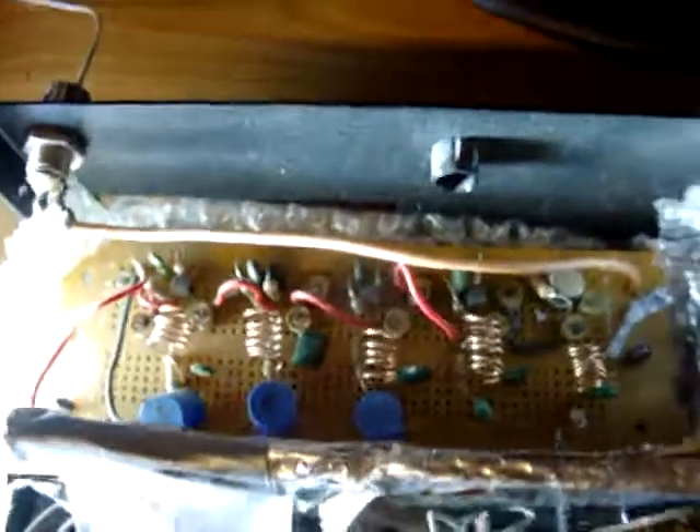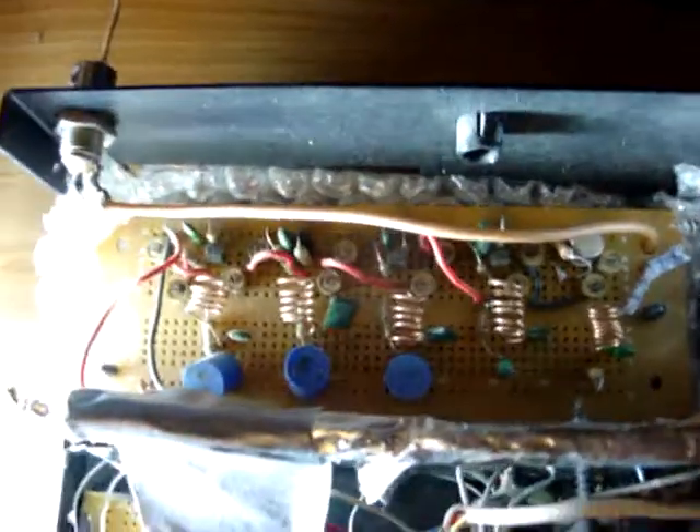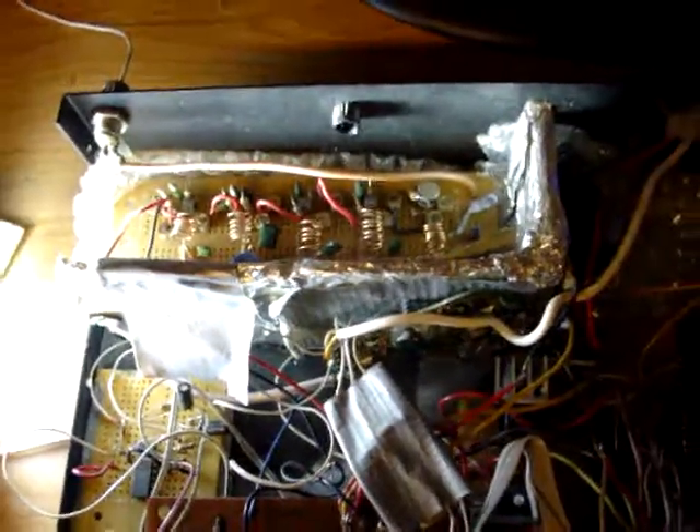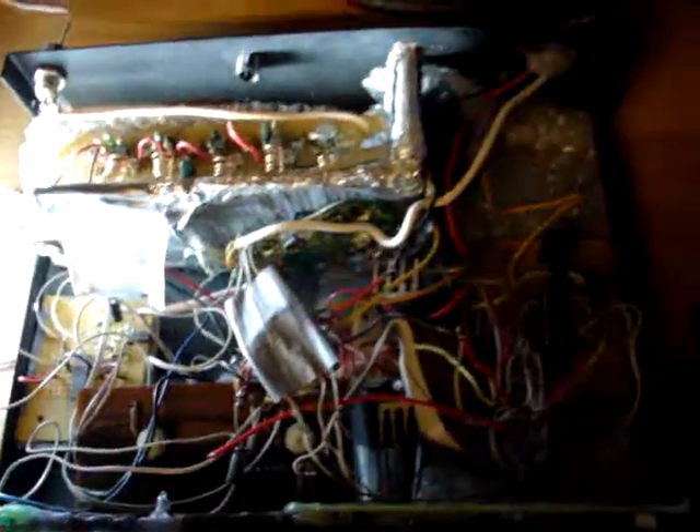But if you're making a broadcast amplifier to be tuned across the entire band, you can see that this circuit is quickly not going to work. You need fewer stages and wider band filtering, but it does provide some impedance matching. So that concludes this video on the specific details of this transmitting system and how it works.